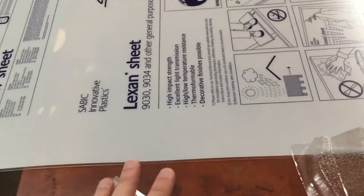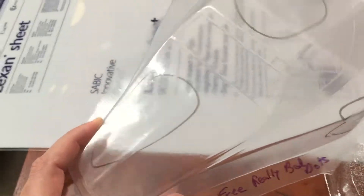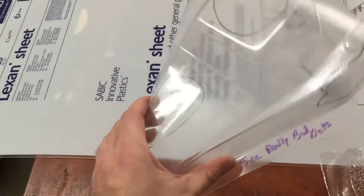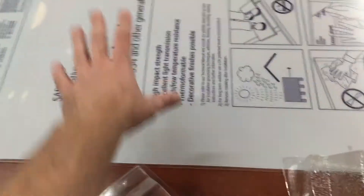The second manufacturer we used was drying at ABS temperatures, which are a little lower, trying to compensate by running longer — and that didn't come out well either, looking a lot like the first batch. On some of their pulls, half the sheet would have the little pits and bubbles and the other half would not, meaning that side either didn't have enough space to vent vapor or wasn't getting adequate heat in that spot in the oven. Eventually we left that place over those and other issues, and that's why we're doing our own vacuum forming now.